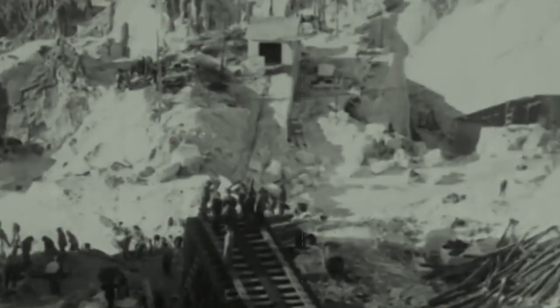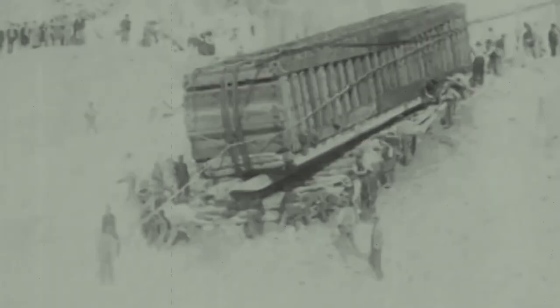Moving a big stone with the most primitive of technologies is not a problem. Now we come to Mussolini's monolith — an absolute behemoth. This is 300 tons on a wooden sled with wooden rails. They're not just going to move it — they're going to move it very precisely. One of the ways they achieve precision is having rails on the outside going in the direction of the move, and cross rails going across which are tilted like a V — so gravity keeps the heavy object in the middle, like a little valley. This is the same principle as train wheels, which have a slight taper to keep the train on the tracks.